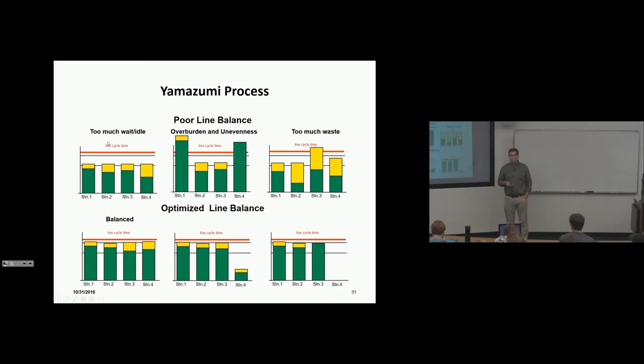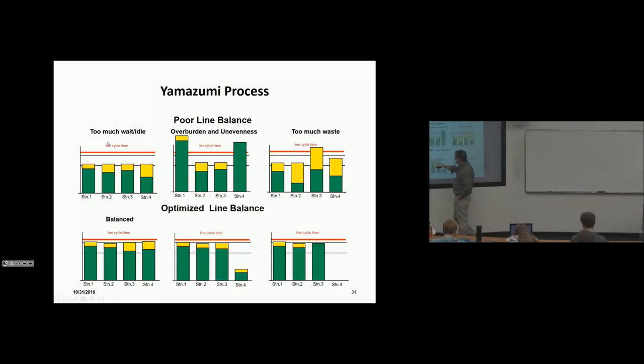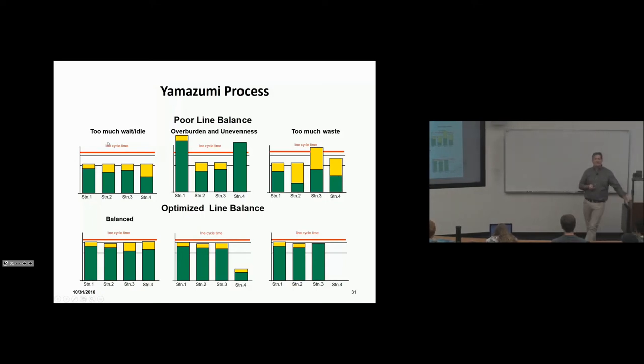A good example of a balanced process shows all jobs closely related visually. In your own cells at Tiger Motors — are those balanced? There's a bottleneck. Why? The TAs say they're balanced using predetermined time standards. Someone says lack of training — but that's actually unrelated to the job capability. It's not part of the data. As industrial engineers with a 900-process budget, training is someone else's problem; your concern is the capability of the system.